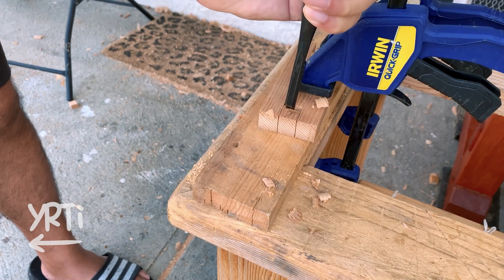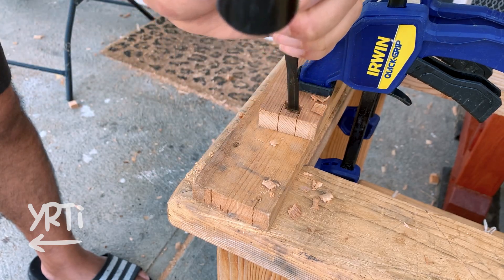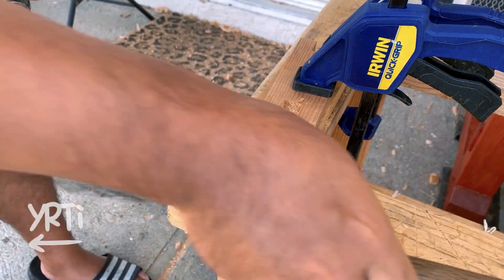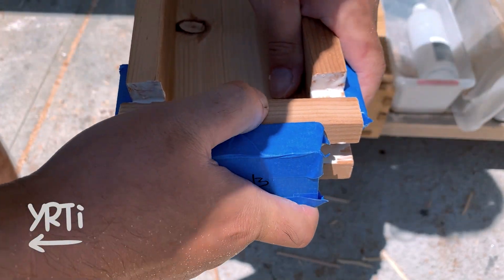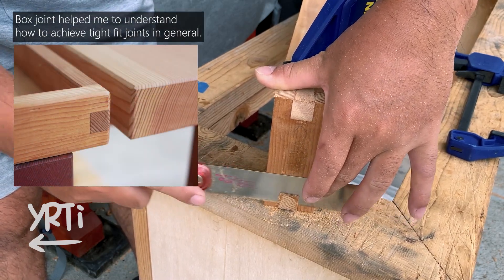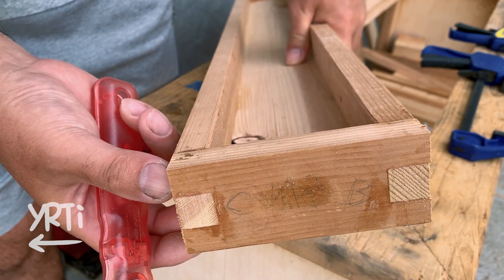And this is my favorite joint — the box joint. I really like it for the quickness of fabrication and its look. I used a cedar fence picket for the bottom of the box — leftover from a sharpening stone case project — and cut rabbets only on the longer sides of the box. Since I don't have an over-40-inch clamp, the glue-up was hard but good enough. If you're interested in what I pay attention to when making a box joint, please let me know — there are several tips and I can summarize them like I've done in past videos.